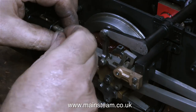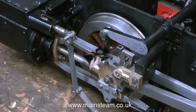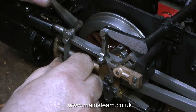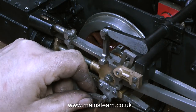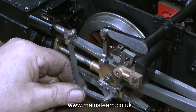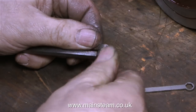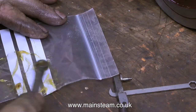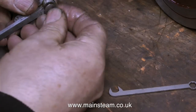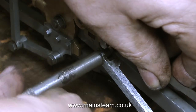I have to put the brakes back on it, but they are relatively unimportant — though once again they need to go in place before I fit the running boards. The refitting of this valve gear was done in real time when I fitted it to the right-hand side of the engine, but now the left side is just a mirror image so I'm speeding up the process. In exactly the same way as with the right-hand side, I'm removing the eccentric rod from the return crank so I can pack the ball race with some grease. Now I'm putting it back together, and in this part of the sequence I'm fitting the other end of the eccentric rod to the expansion link.